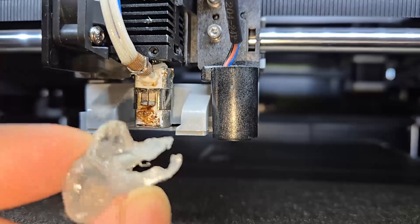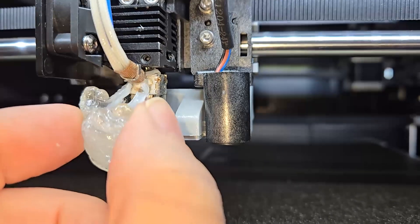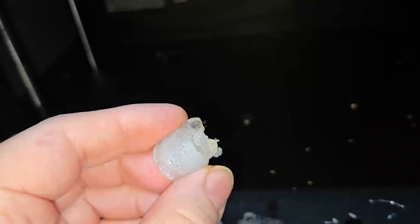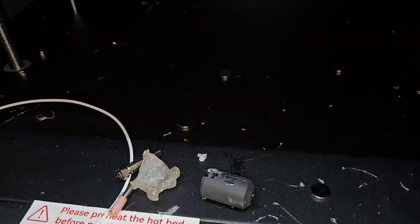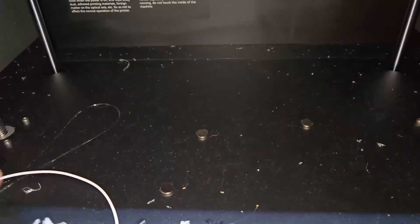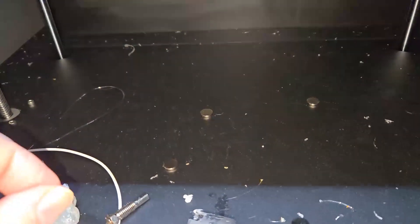When I pulled it free, I found this kind of yoke here that was around the wiring. I had to heat up the nozzle and pull very gently with the softened chunk of plastic to get it out. On further inspection, I found that the nozzle was actually broken in half at the ceramic heat break. What a surprise — that's the weakest design ever there was.